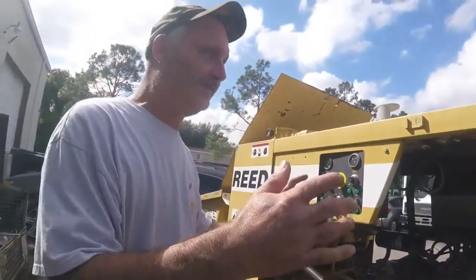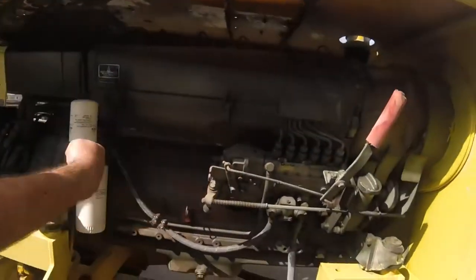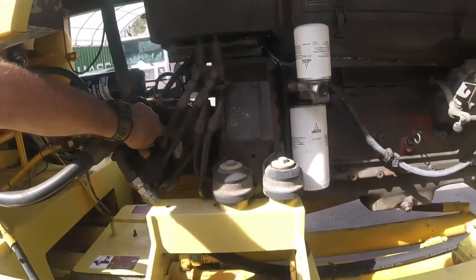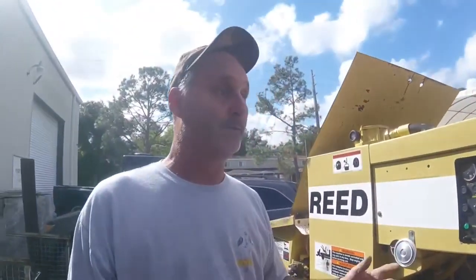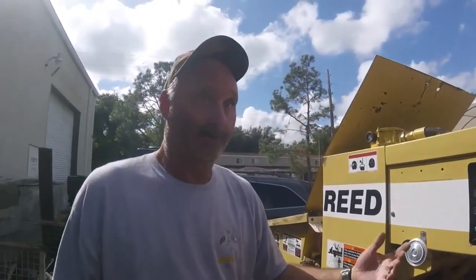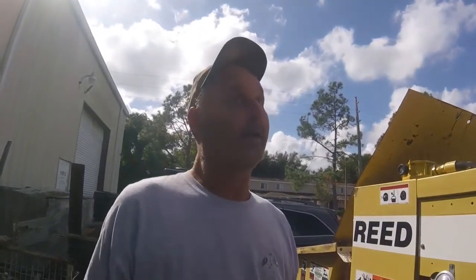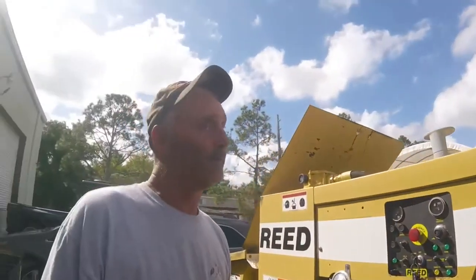So about the engine, since we're on this topic, you see the engine runs through the shaft, through the bell housing, into the first pump, and then into the secondary pump. So it's a straight shaft. In theory, if you run this motor at half speed and raise it up on the hydraulic side, the machine's not cooling itself or cleaning. That's the reason why you must run the machine all the way out, 2100. That's where it's going to go.